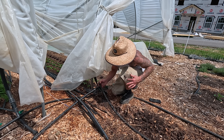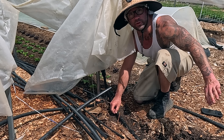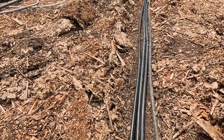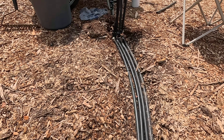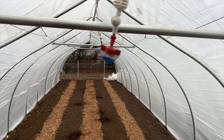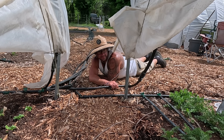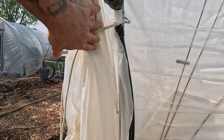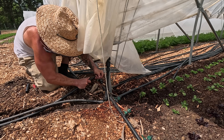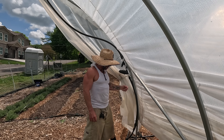I'm going to plug it in and staple it down right here to keep everything neat while I'm working. I'll leave the staples in when I bury it — that way if we ever need to dig them up everything will be nicely separated. I'm going to test the sprinklers now because if there's any problems I want to fix them now. The overhead line for this tunnel comes in right here and elbows up, then this line elbows off into the drip lines, and this one is the overhead irrigation for this tunnel. All four are set up independently on the timer.